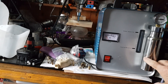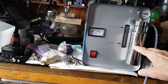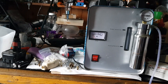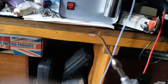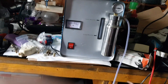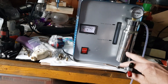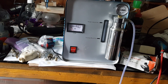They recommend that in the bubbler here — I've only got water in it at the moment, half full — you could put alcohol in there, which changes the temperature of the flame on your torch. There are other videos on YouTube where people have put different stuff in it and checked how the temperature changes. I believe paraffin/kerosene is a recommendation by some people, but I haven't tried that yet.